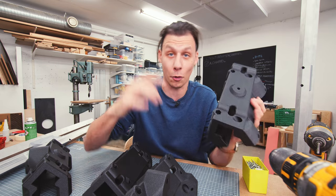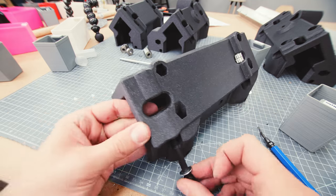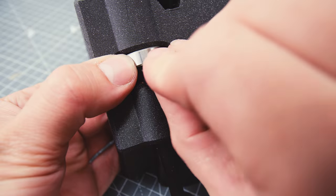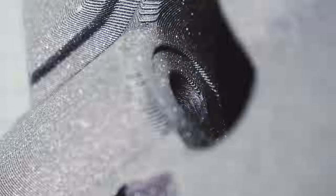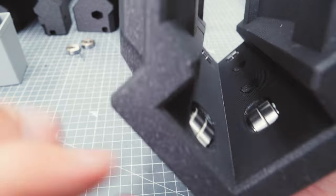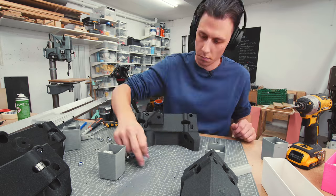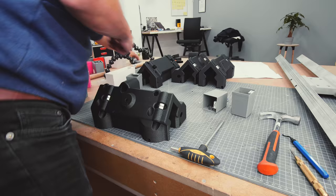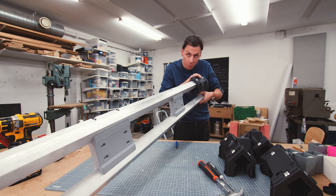These four pieces are what connect the two main assemblies and allow everything to slide and move freely and smoothly. Each one is about 700 grams of filament - pretty sturdy - and they each took 30 hours to print. This is the galaxy black filament by Prusa, which they kindly sent me for this build. 32 bearings later, we've got all of these set up and ready to go, and these can now go on the end of the aluminum tubing.